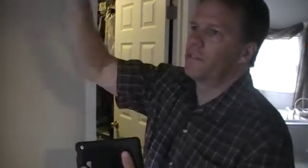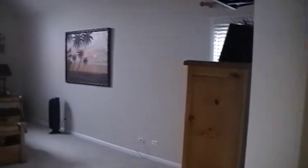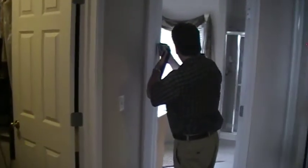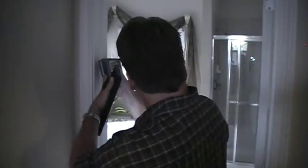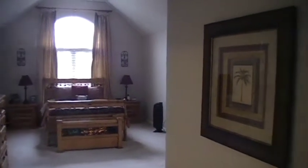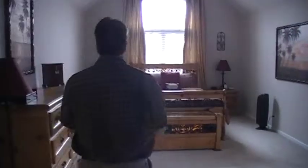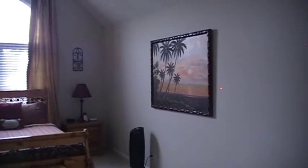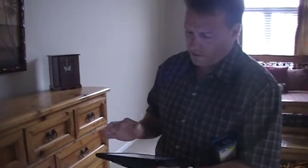What is the full length of this side of the building? I'm going to go all the way to those blinds from the bathroom. If you don't want to get into a sunken tub or have obstacles, go to the door frame and add. I'm going to shoot at that back wall and add from this position, all the way to those blinds — and I've got forty-five feet. The distance of that outside wall is forty-five feet. Now for the width of this room, put the butt of the Disto against the wall, target where you want to measure to — you've got thirteen feet, and with six inches on each side, fourteen feet is the width of this room.